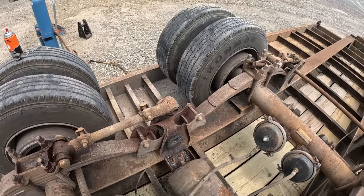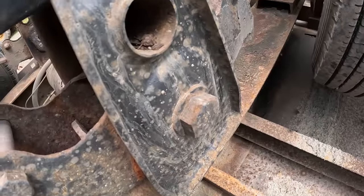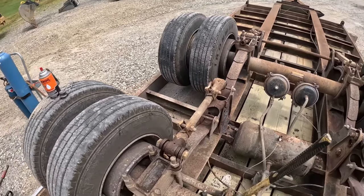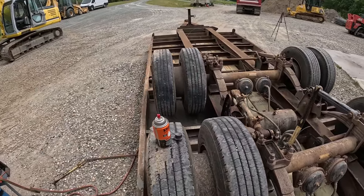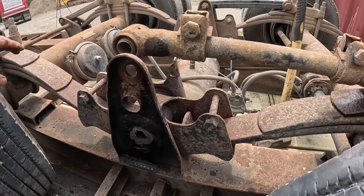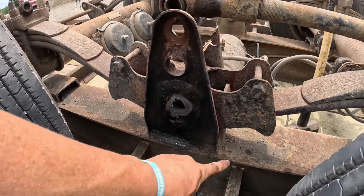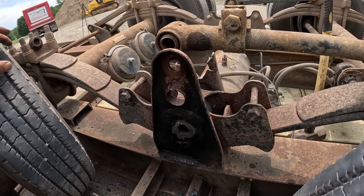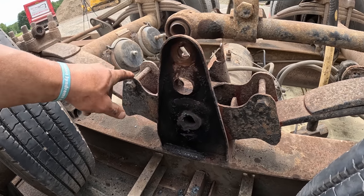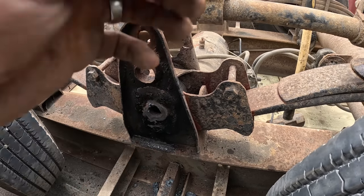All right, everything's loose. Now I'll put a regular bolt like this through there instead of that kind of pin, just a regular bolt. I should have those in stock. Everything stays there: the shackle, the springs, and this hanger. That stays there. You're gonna work this up, cut this loose, work this out, and then work the new one into it, if I remember correctly. Once this is out, this piece is just hanging in there, just loose. We'll figure it out as soon as we cut this loose.